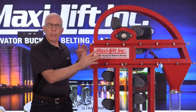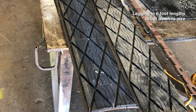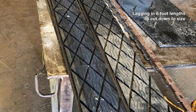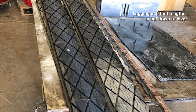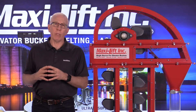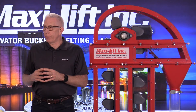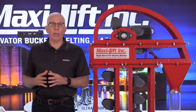When I explained how the slide lag goes in and out, he asked if it comes in little pieces to fit the pulley width. I told him it comes in six-foot lengths that you cut to size. He said he thought they had some in the maintenance shed — and sure enough they did. So don't assume that everyone doing maintenance in your facility knows exactly what's going on. Feel free to call us at Maxi-Lift; we're glad to help in situations like this where it's an easy fix. Fortunately, they had the lagging they needed and the elevator ran much better after it was installed.